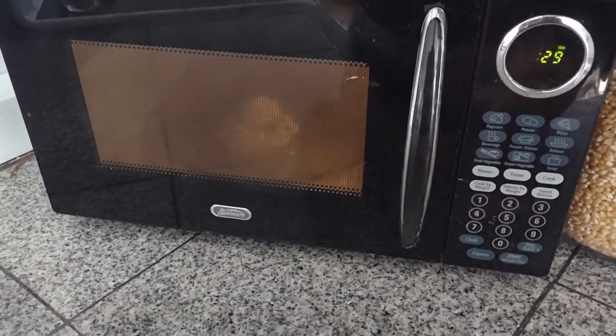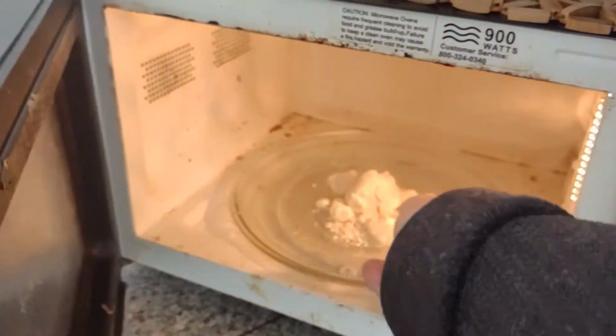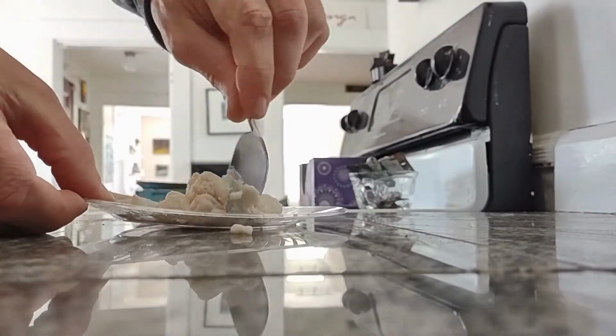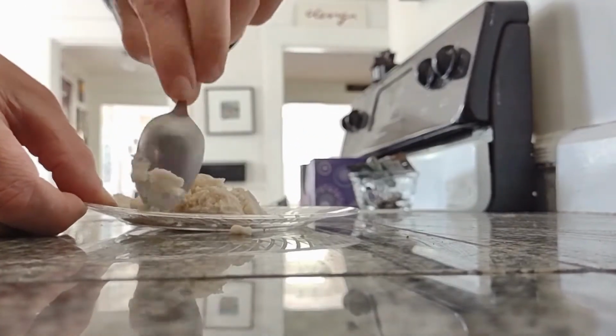After you have mixed it 2 times, let it cool for about 10 to 15 minutes until you can handle it in your hands. Knead this putty for 2 minutes until it is super smooth and there's no bumps or other texture in the actual putty. You're now ready to use this putty.